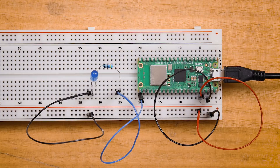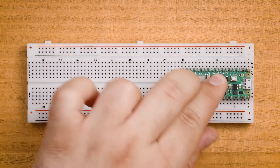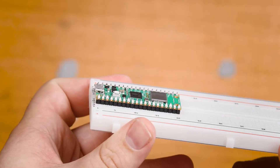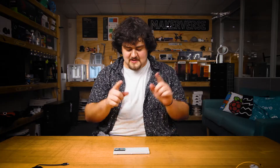Now we're going to wire up some circuits, starting with the circuit from last video — just that LED and resistor combo. Remember, as always, we should ensure that our Pico is unplugged and unpowered before we start wiring up anything to it. A good first move is to place the Pico into the breadboard on the center edge here, with the USB sticking out on this side, so it's easy to plug that USB cable in. We're going to start by connecting the power rails of the breadboard to the power output pins of our Pico.